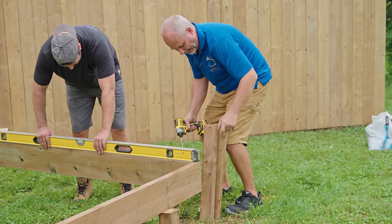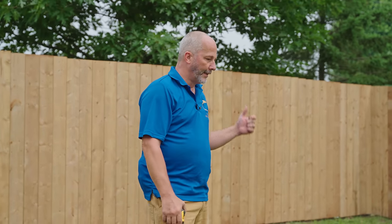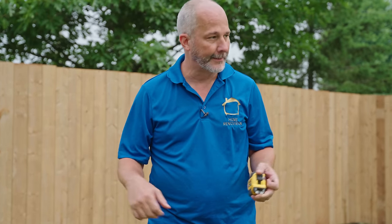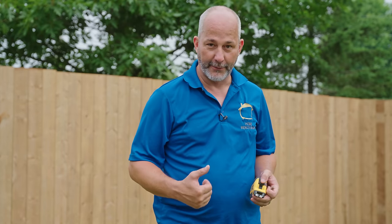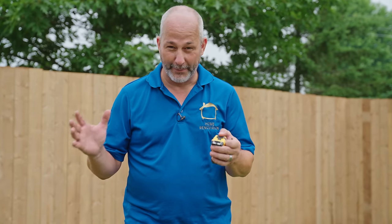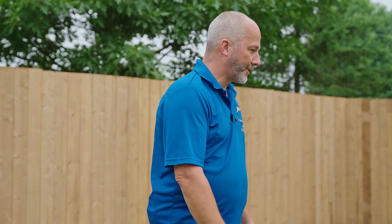Now we've just got to bring all of our cut joists, line them all up, nail them on, and then after we nail them in we're going to add the floor joist hangers. The hangers are just there for good measure, for longevity — we're not relying on them for the structure, we can rely on the nails just fine. But we're going to add them anyway just to give us a little more beef. It's in the structure where it's a great time to do overkill. Let's get these all fired in and then we're ready to sheet it.